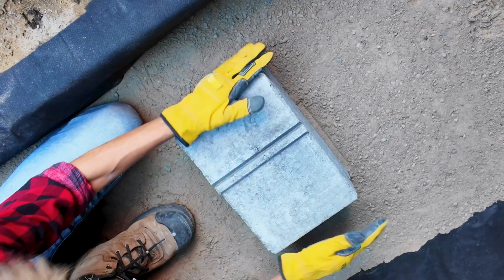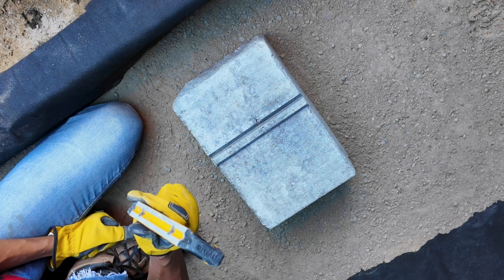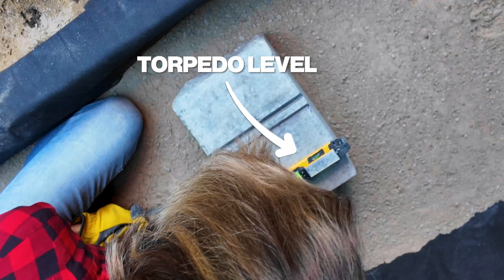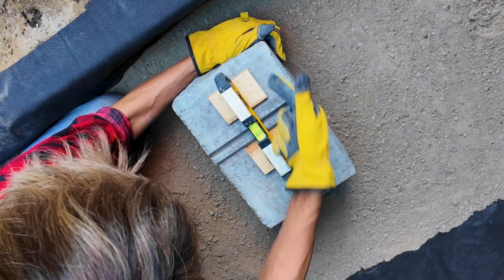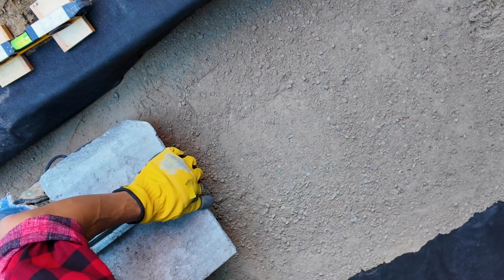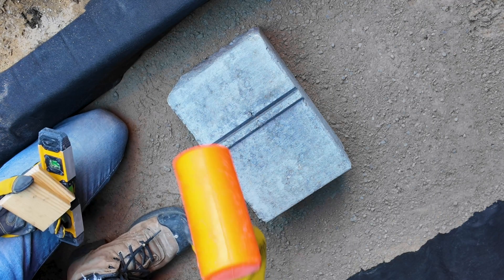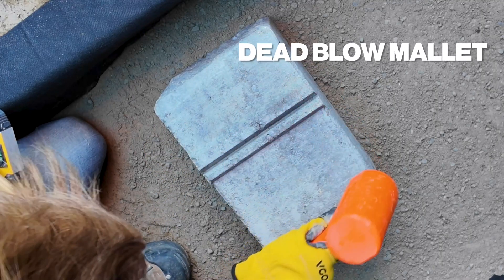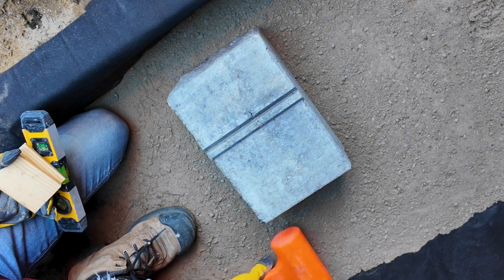This is what I'm installing today. It's heavy — about 43 pounds. Get out your level; this is gonna be your best friend. Can you see that little bubble? It's telling me that side is low. If I lift that one side up, you're gonna get level. Give it a little dusting of aggregate, a little bit more. Once you've done that, grab your hammer — it's got a dead blow, a great tool. Give it a whack to help set your block in place. This is a four-pounder and I will link it in the description.